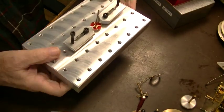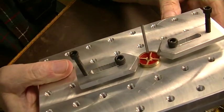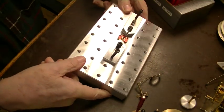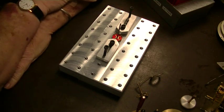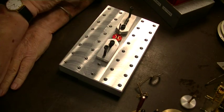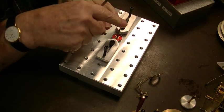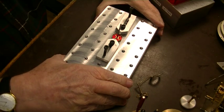If you remember, I think it was part two, we had this bottom wheel down there. And this is the original wheel here, and this is called a mini plate that I made years ago. I actually got the idea from Tom Lipton, but I made all this, and this holds things down very, very well. I made sure everything was very square. This fits on here just perfectly. It's all centered with a gauge pin here through the middle that just fits in a slip fit. So I think this is going to work.